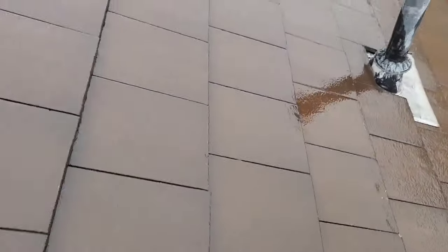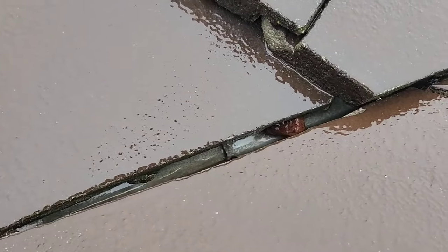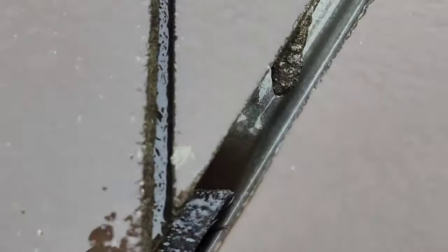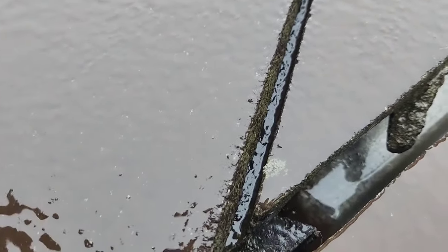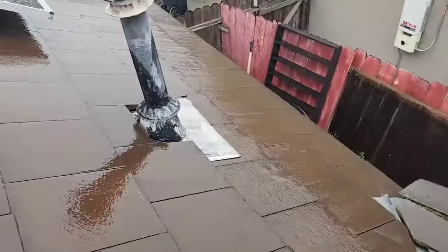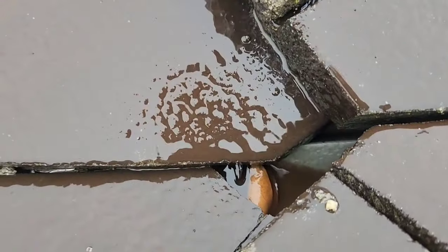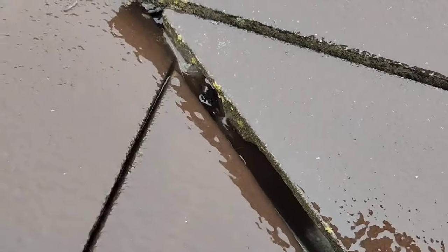I think I see what's going on here — it's in this valley area. You can see the water is running pretty good in there and there are a couple spots where it's damming up a little bit. Right here it's damming up; this water should go — see, the water starts running again. So you've got some damming going on here. Water runs pretty smooth until it gets to about here, where you can see it's damming up again really bad. You can see the water building up, and the same thing down here — some major damming.